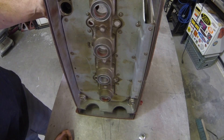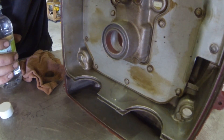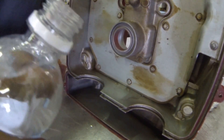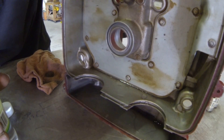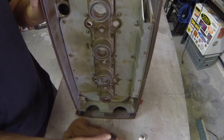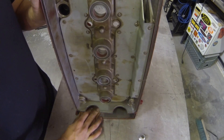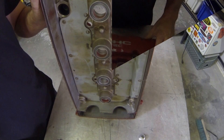We'll take our white vinegar and put a little dabble on the inside. Just put a little on there, let it sit for a second. Looks like nothing. Let's test the bottom here as well — just dump a little on there, swirl it around. Notice how it looks like nothing more than water. Since there was no reaction at all, we know we have an aluminum valve cover, which means our aluminum fittings with our aluminum filler rod will absolutely service this valve cover.